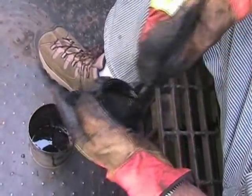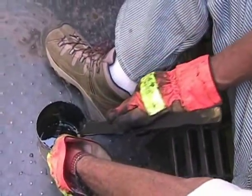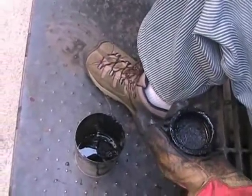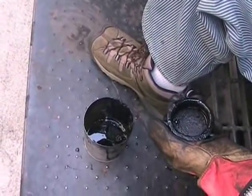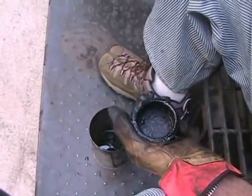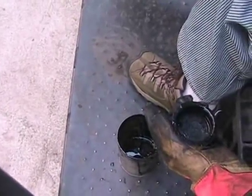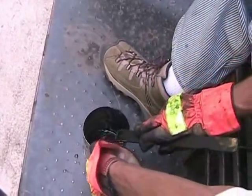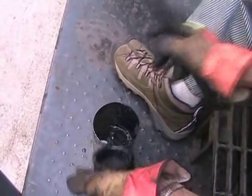What happens then is that the cylinders get a buildup of something like lacquer, and that buildup prevents the rings from scraping the cylinders and moving the oil back down. And that buildup allows the oil to go around the rings. The solution is that the engine needs to be run harder.